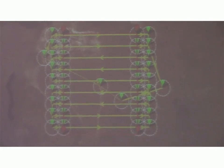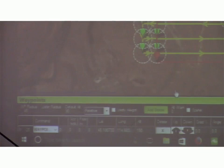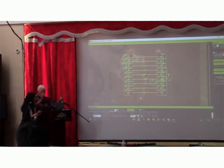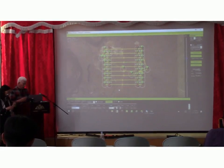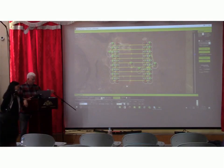So all you have to do now is go to the site, put the drone together, collect all the electronics, make sure everything is working correctly, and when you get green lights and your GPS has got a decent position, you're ready to fly. Someone holds it here and the other person switches this to auto. The minute he does, it'll go to full power. You just release it, and you start always in FBW, which is fly-by-wire manual. So if all goes well, you don't do anything until the thing comes back and lands in the grass.